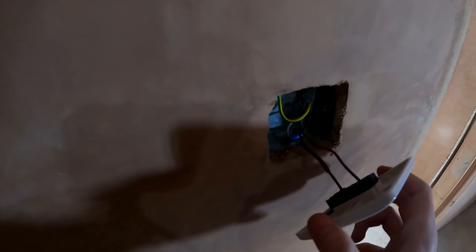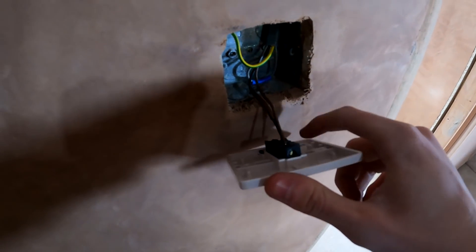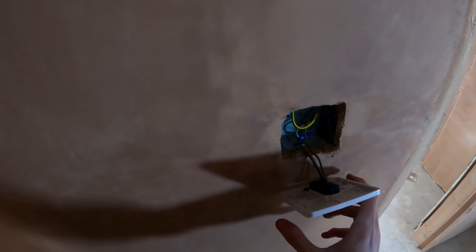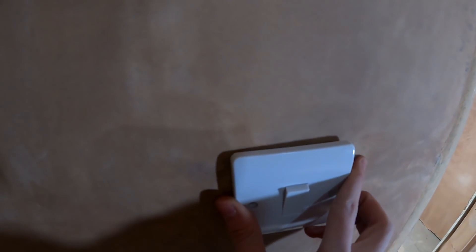That's all terminated. It's quite dark here but it's a bit of a strange one - normally these click accessories have a plate around the bottom with two terminals on each side, but there isn't one here. So I'm going to take the earth fly lead out and just put the earth into the back box, so when I screw the pins back it'll be earthed via the pins touching the metal on the back box thread. I'm going to try and bend the cables back one-handed.